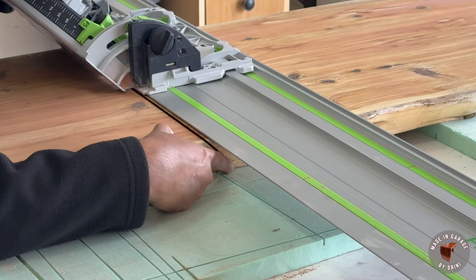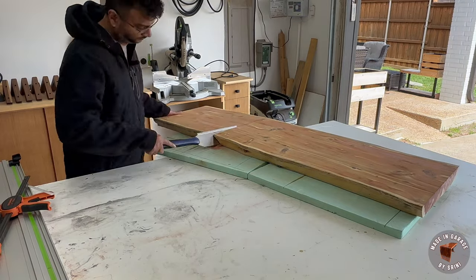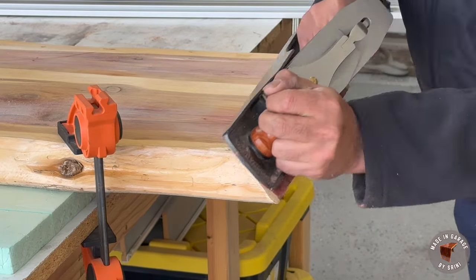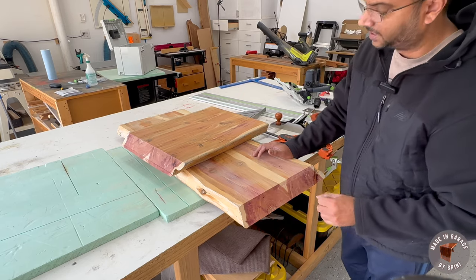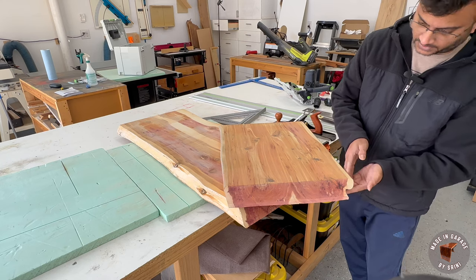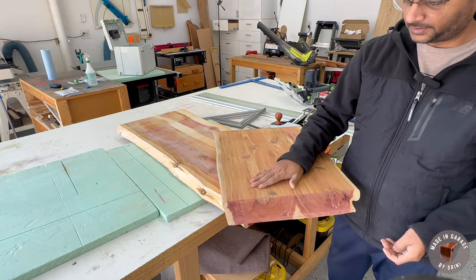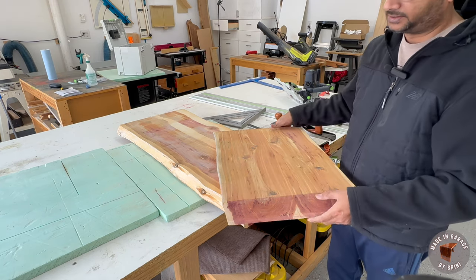The miter cut did not go all the way — you can see there's still some wood left. Let me put some elbow grease in. After hand planing I think the angle is perfect, but we need to check it. For this we need to make another cut from this side to get the 45-degree angle so the grain will match. I'm thinking the best option might be the table saw, because the track saw isn't even cutting the full depth and this is also a small piece.